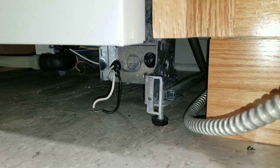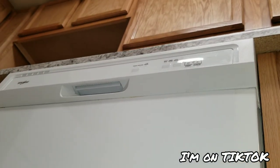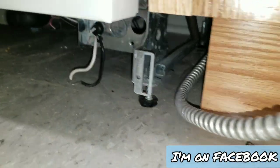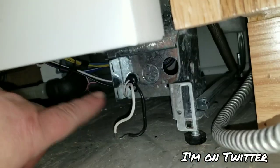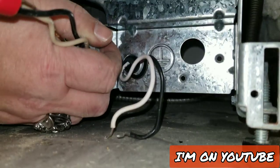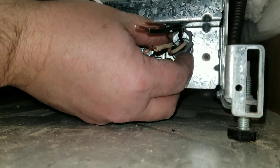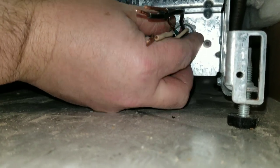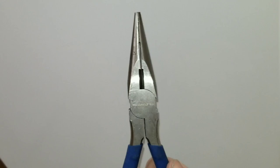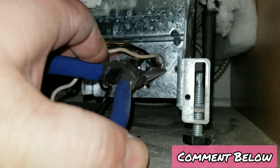In some cases it's a little bit easier to leave the dishwasher hanging halfway out so you can reach back in here, grab your wire and conduit, and get this thing wired up. Then scoot it all the way back in at the same time, before you mount everything to the top of the countertop. If you've got enough room, we're going to reach around through there, take these wires, and feed them through the backside through this little hole here to get everything hooked up. I took all three wires and put a wire nut on them so I can feed them through the hole a lot easier. Make sure it's routed around all those springs and running directly beneath the dishwasher so it can run through this hole right here. You can see that red cap right there — pull it in and get it set in place. Now pull the wire nut off, run your lock nut right over top of those three wires, pulling them through as you go to help hold it in place so you can catch a thread. Run that lock nut down, make sure it's good and tight — hand tight works fine. Get your long-nose pliers, strip them around each end of the tab and tighten them up so you know it's good and tight and not going to come loose.